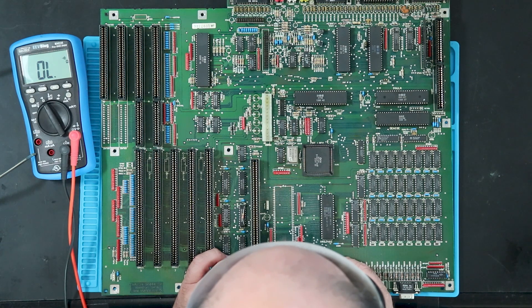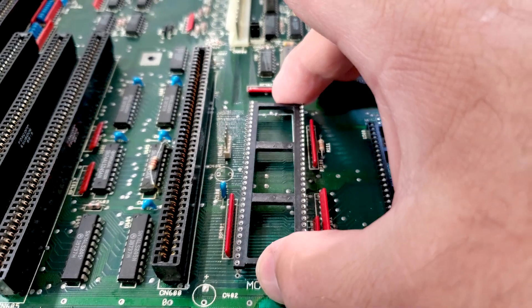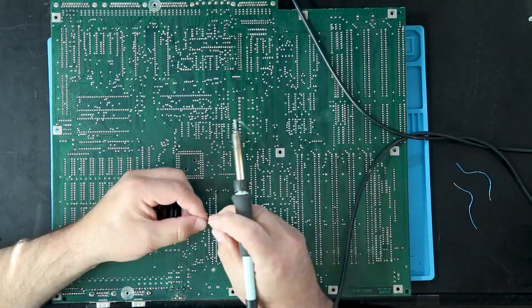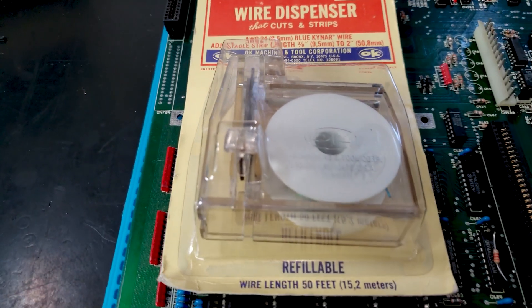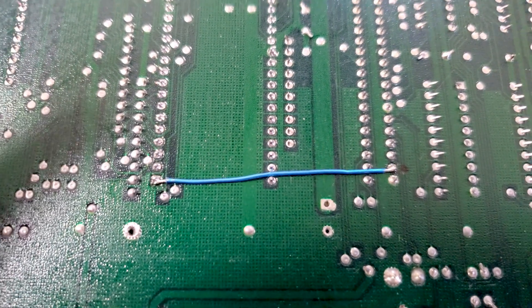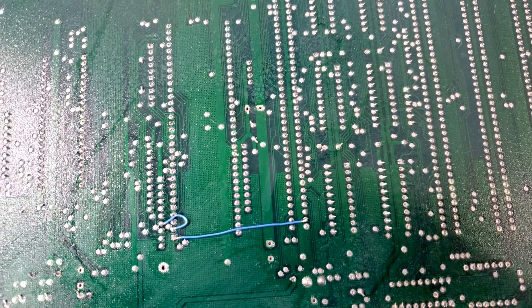I checked the continuity from the corroded traces on the processor socket to their adjacent connections and found a couple that were not making a connection, including the one where I lifted a trace. Before installing any bodge wires, the replacement CPU socket needs to be installed. I'm using a turn-pin socket, though a lot of people prefer a double-wipe socket for easier soldering — whatever you prefer should be fine as long as it's not the single-wipe garbage that was in here originally. I used fine single-strand wire to make the bodge wires, and for a retro machine, what's better than a new roll of vintage wire? One short wire ran over a via too close to the connecting points, and I was afraid heat from the soldering iron would burn through the insulation causing a short, so it had to be routed around.